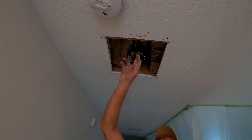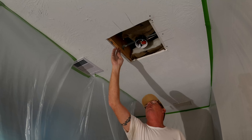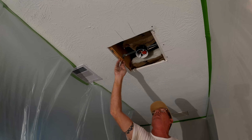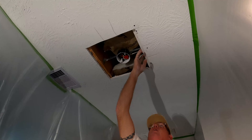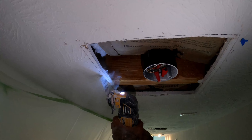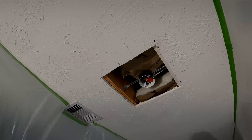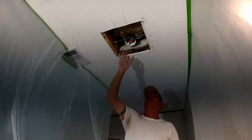On both sides so I know where my center is, so we can route this out. It's kind of a tricky little patch — always try to go straight on a stud, so at least have one stud, and then put a piece of dummy wood here. We're using the multi-tool. After I've mapped everything out, cut everything nice and square, I got my piece done.